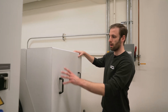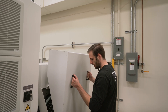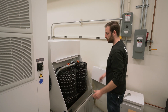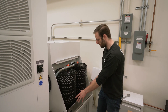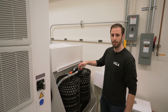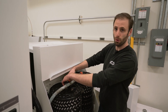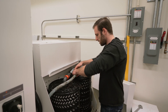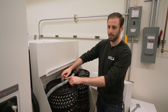The two drum filters are in this compartment, so what you need to do is just pull up to uncover the two filters. If you're going to be replacing the filters, it's a good idea to keep the water off for a while and let the two filters drain completely so you're not getting water everywhere. The two filters are connected with these quick disconnect valves — you can't take them off until you close the valves. So the first thing you do is just twist and close the valves.